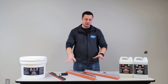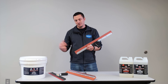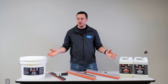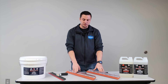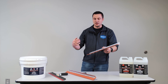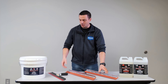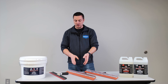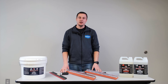There are lots of different techniques you can do when using different squeegees — you can go wider or thinner. There are notches even bigger than this; maybe if you're doing urethane cement you could use a notch, but usually you'd use a gauge rake for that. For most epoxy products we sell, you're going to be using these three squeegees — the thick flat and magic trowel being most common for flake and quartz systems, and the notch and magic trowel most common for metallic epoxy systems. The notch gets your base coat spread to maintain thickness, and for wet-on-wet metallic you may do a full wet prime with the magic trowel, then pour your beans or ribbons and use the magic trowel or roller to manipulate it. Hopefully that answers your questions about the small notch, thick flat, and magic trowel flat squeegees. Comment below with any further questions — we're happy to answer. Take care.